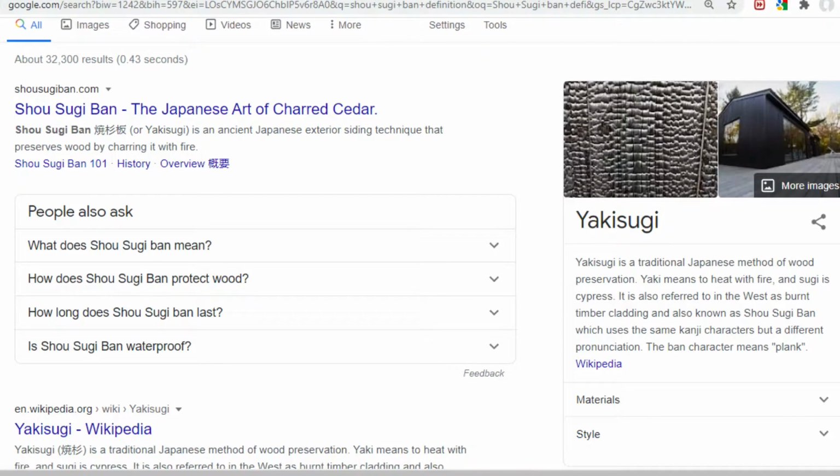So I sanded that, and then I'm going to show you one of my favourite techniques, which is something like shou sugi ban or something. It's a Japanese technique of scorching the wood. They usually do it until it's completely charcoaled on the outside. It's a way to preserve it and things like that, but I only do it until the grain, because the thicker grain burns faster than the thinner, so it really makes it striped.